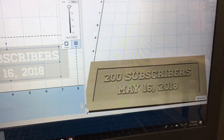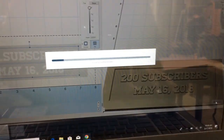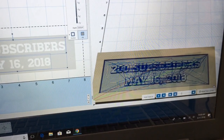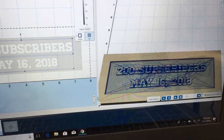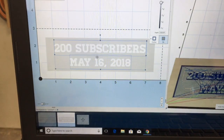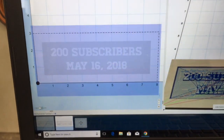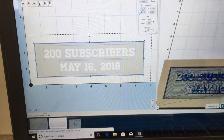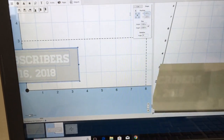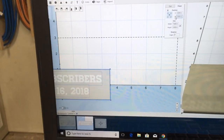To see how long it's going to take, I'll go ahead and select Simulate. That gives us about seven minutes for the roughing pass and about 17 minutes for the detailed pass. Now, I don't want my XY axis to be at the corner — I want it dead centered. So I'll select the entire project, go up to the shape menu, select the center position, and set the coordinates to zero and zero. That takes care of the X and Y axis.